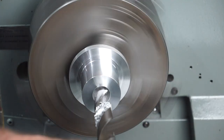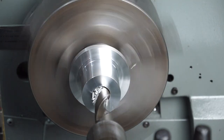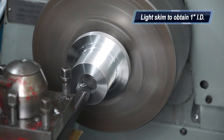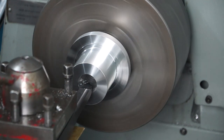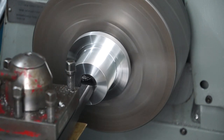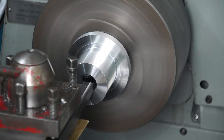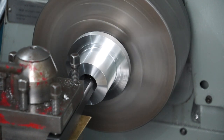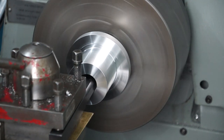The Colchester had no problem pushing that large drill bit through. It's a 3-phase 415V machine, though my phase converter has been set down for my Chinese CNC milling machine which runs at about 380–390 volts, so I'm a little down on voltage — but it doesn't have a problem at all. I'm now going in with my boring bar to bore that internal out to 25.4mm, which is 1 inch. This is just a light clean-up cut.